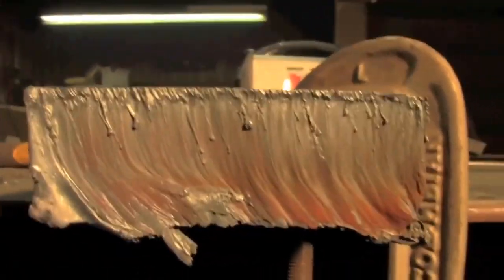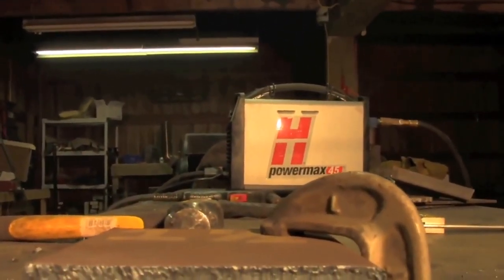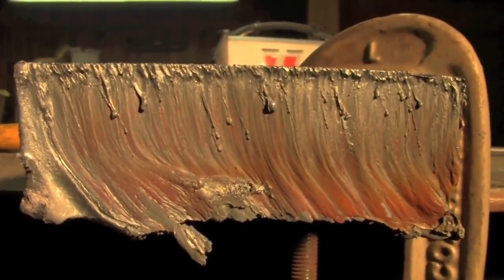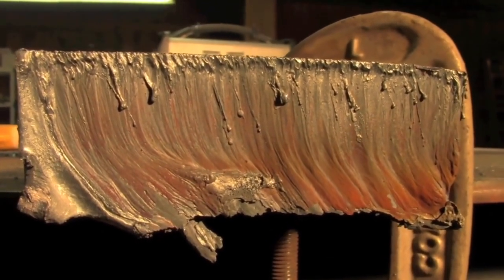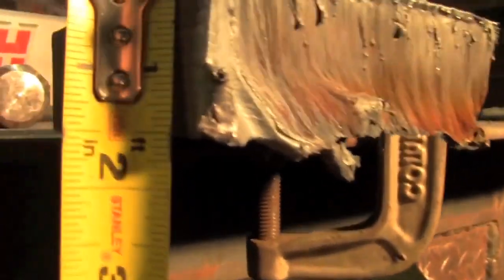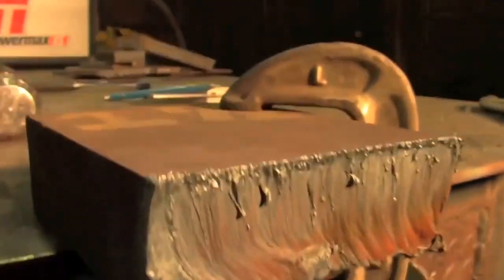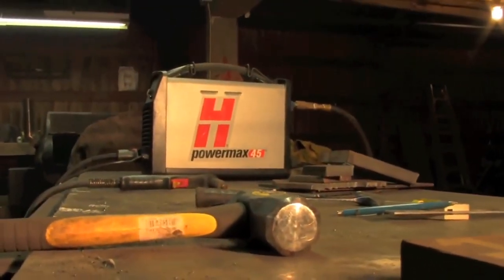That is a nasty, messy cut as you can see. It is not a fun way to work with metal at this point. I'd say I'd define this as fun up to an inch, including an inch if you're patient, but this is not a pleasant way to work with metal. However, if you have some 1.5-inch plate and you're working on a project and you only have to cut a little bit of it — or you have a lot of time on your hands — the Hypertherm PowerMax 45 will definitely do it. And just for the eventual naysayers out there, that is definitely 1.5-inch plate — and on top of that, it's rusty 1.5-inch plate. But rust is not a problem for this machine whatsoever.